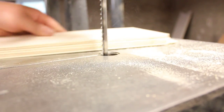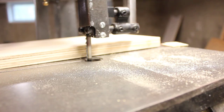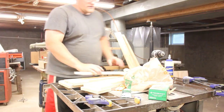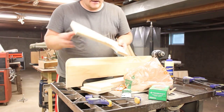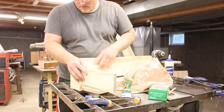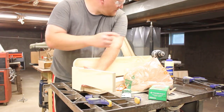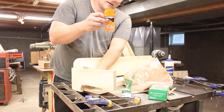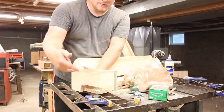I could use the trick to attach all these together but my bandsaw doesn't have enough power for that. So I have the footboard and headboard cut out and sanded. I got my ends here — the rail brackets will get screwed onto the end there. And then the longer rails are going to sit on the inside, and I have quarter-twenty T-nuts that will go on the inside of the rails and screw those on from the outside.